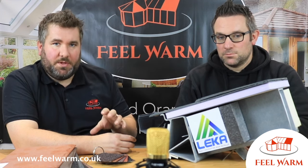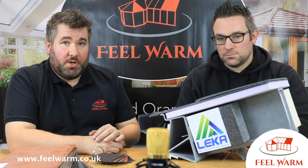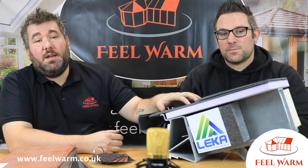But what they do is they say you have to conform to the local authority building controls website. And you link through to that, which is a national website, set up to cover the entire country. In their documentation, they are very, very specific that you are changing the thermal properties of an existing building, or you're building effectively a highly glazed extension. In which case, the thermal properties of that roof need to be properly assessed by a building controls officer. We need to make sure that you're getting the right insulation, and that things like fire regulations have been adhered to as well.